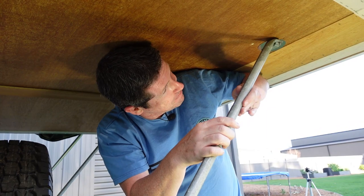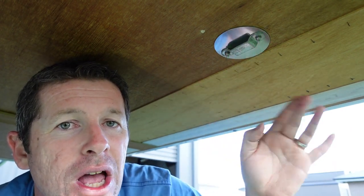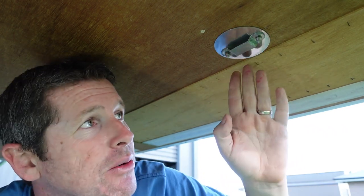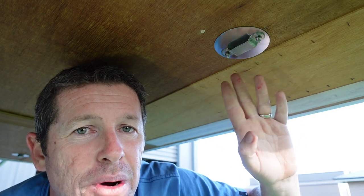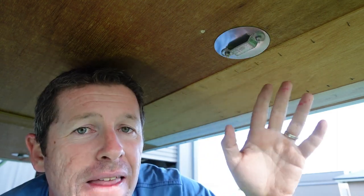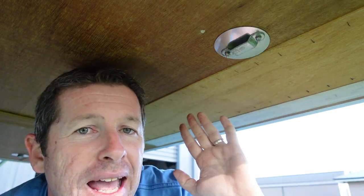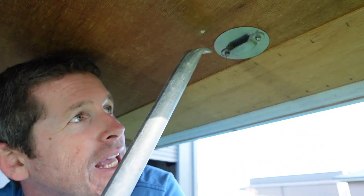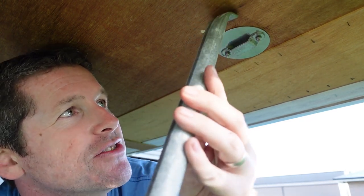And just like that, it slots in. We are done. Just one thing to note — our board has a joiner strip that runs through the middle. What I had to do was manipulate this disc forward a little bit so that it wasn't deflecting and trying to skip over the back of the joiner piece. That's a little detail you want to have a look at when you go to install yours. It's a little bit fiddly holding the bolts in and making sure you don't drop the nuts and washers when assembling it. But really it's a 10 minute job. It looks a lot better, it's nice and neat, and most importantly when you want to slide these in, they go in really, really easy — and you're obviously not scratching and damaging the top.